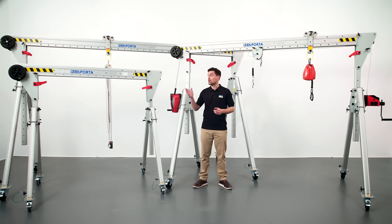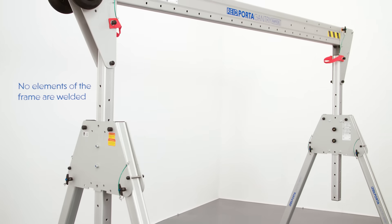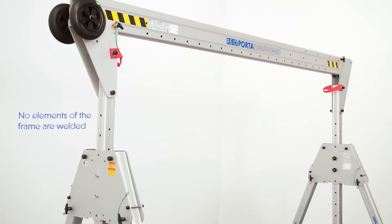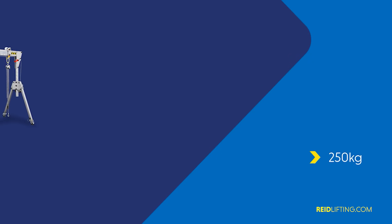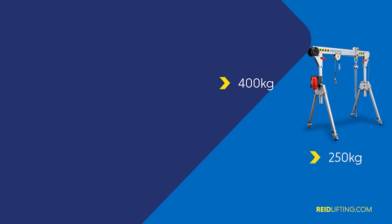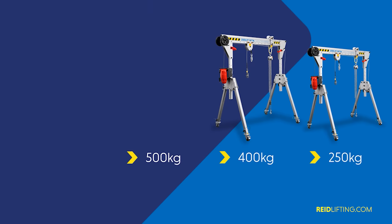This gives you a clear operating span of up to 3.5 metres. The units weigh from just 33kg for the smallest to 62kg for the largest, demonstrating a tremendous strength to weight ratio. No elements of the frames are welded, eliminating the potential for weld fatigue and catastrophic failure of the lifting device. It's also available in different capacities for both lifting goods and lifting personnel, from 250kg to 1,000kg.